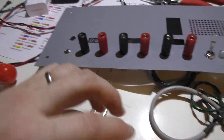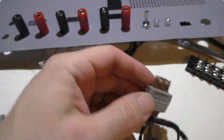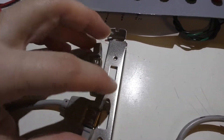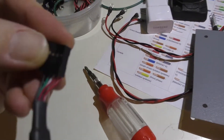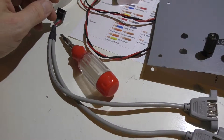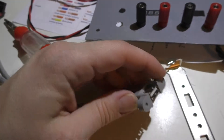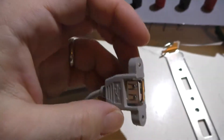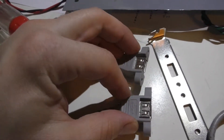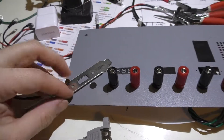I'm going to try to make some kind of graphics for this when it's done. The USB connection I was using was basically this piece — one of these guys — and this is a PCI slot cover with two USB ports mounted to it. If you follow the wire down to the end you'll see the piece that connects to the motherboard. I basically cut this off, soldered longer leads onto the red and black connectors. The white and green are for the data — you can omit those because you're not going to be able to use them. I'm going to go back to the original idea of just having these mounted with screws, and this becomes useful because if you cut the top off you can lay it flat and use it as a template.